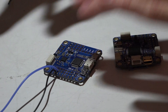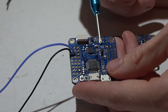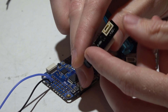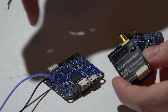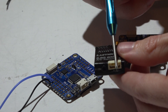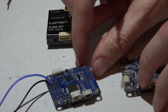So how am I personally doing this? I have my camera video wire going into the video-in pin and my video transmitter wire coming out of video-out, and I'm not using the ground or power pins on the flight controller. I use video transmitters like this one or the Cricket, which accept full battery voltage — up to 19 volts — so I run power and ground right off my PDB, technically right off my LC filter. These video transmitters also have a voltage regulator built in that kicks out 5 volts, which I use to power my camera. So all my power is separate: it goes from the PDB to the LC filter, back out to the camera, and I don't have to deal with any of this.